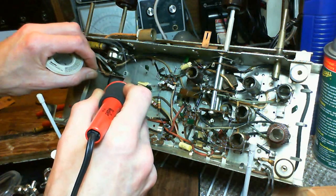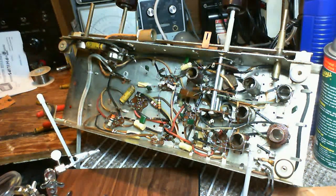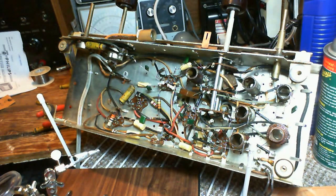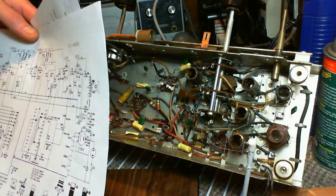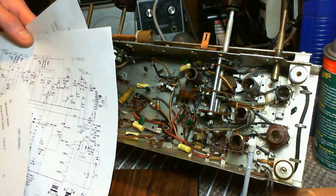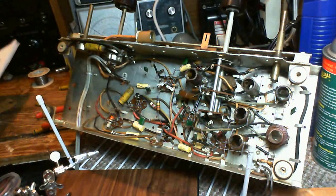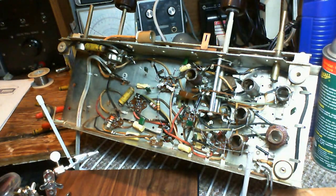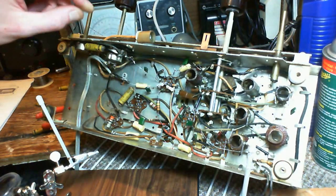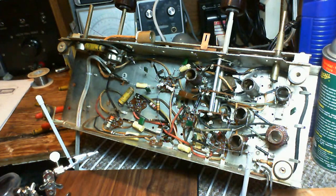There could be some resistors in particular circuit locations where failure would generate that kind of effect, though not any failing resistor would cause that kind of noise depending on where it is in the circuit. We've also isolated it — we know it's not in the audio circuit, it's probably in the first RF amp area. The first thing is the mixer tube, followed by one IF amplifier, so in those two circuits is where this crashing is coming from. And of course the two IF cans are in there.